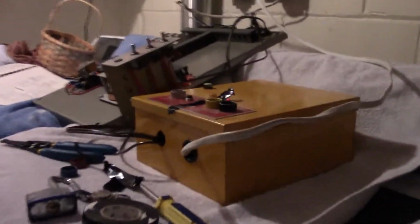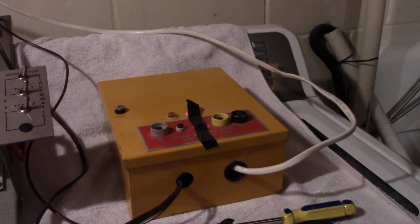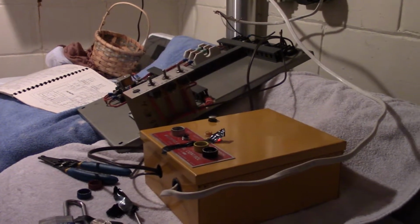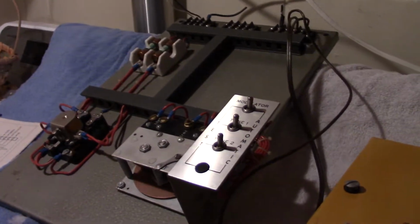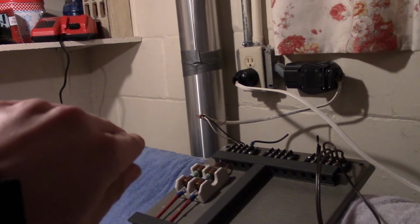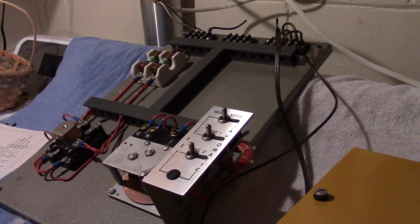Okay, so let's turn it on right now so you guys don't get too dizzy. This camera is supposed to self-stabilize a little bit, so we'll see how well that works. Right now you'll hear this switch here engage and disengage. When the AF timer in whatever fire cycle you're running gets to the dip in the cam, when the siren's winding down, that dip also tells that switch to disengage, turning off the tone modulator and the solenoids. But when that switch is going up the cam, that tells it to engage, and for the siren rotor, or whatever is making the noise in the siren, in this case a chopper in the 1003, to turn on.